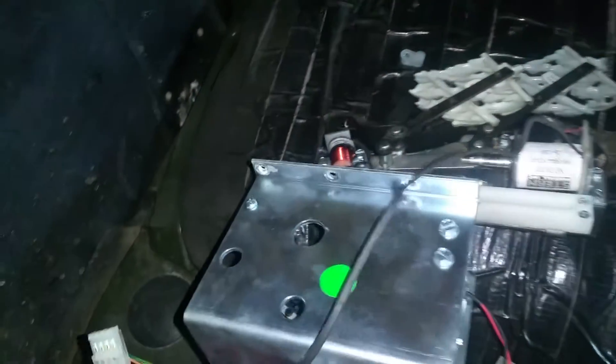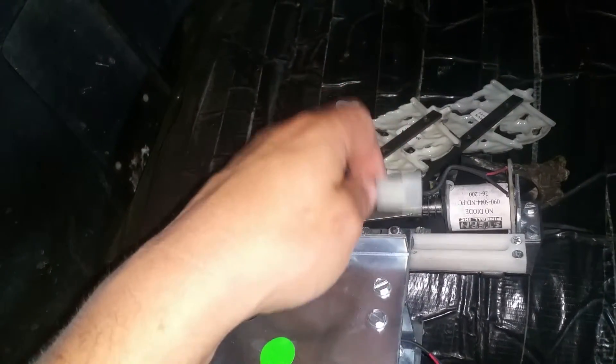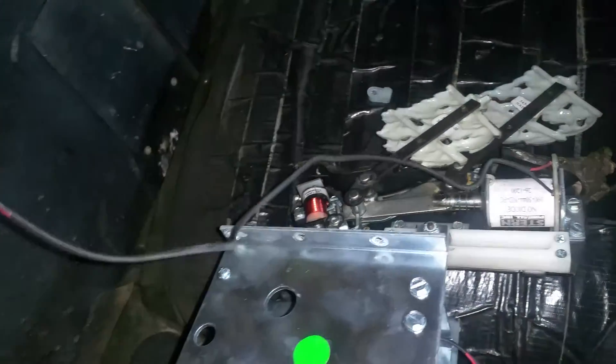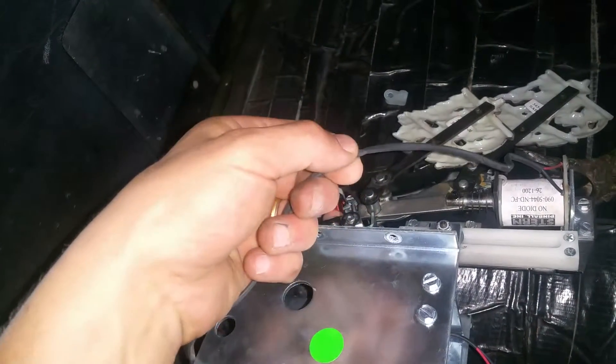In this case we thought we might have a bad coil, but then we weren't getting continuity through the wires from one end to the other. Just put a multimeter on it and you can tell real quick — even while the ship is mounted to the playfield you can reach your multimeter down in there and check. That's the first thing you should do: check for continuity, and if you don't have it, find where it broke and fix it or replace the wire entirely.